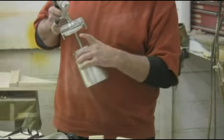Again, what I want you to do is just watch me spray. Pay attention, not to me, but to how I'm working the gun, the overlaps. Now, you notice the way we're set up. Normally I could run a little bit of masking tape along these shelf edges, but I'm not going to get that much fluid, and I'm not going to build these edges up that much. When I'm done finishing, I'll just lightly scuff them with a piece of sandpaper to make sure they fit in my dado.